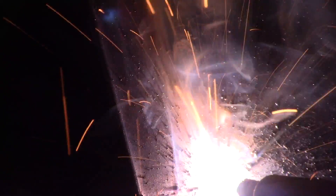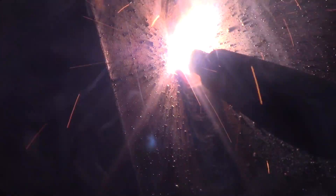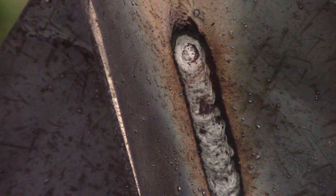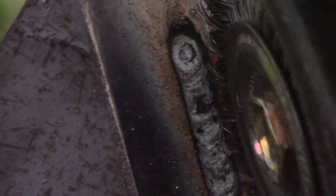You can make decent welds in both directions. Here's the bottom-up — it's more like a Y shape now, pretty much the opposite of what I did going down. You want to tilt your contact tip slightly upward, and gravity will take your slag back behind you, so you don't have to worry about trapping slag under your weld.